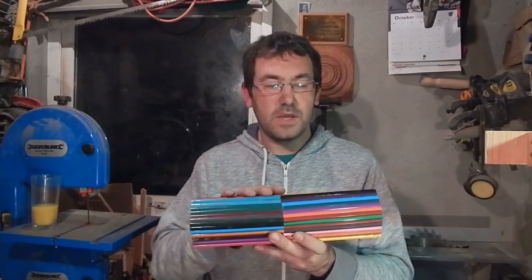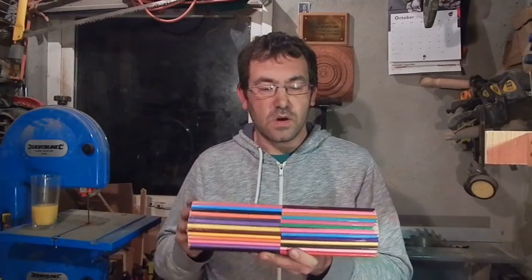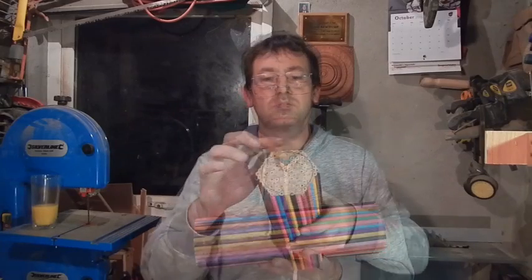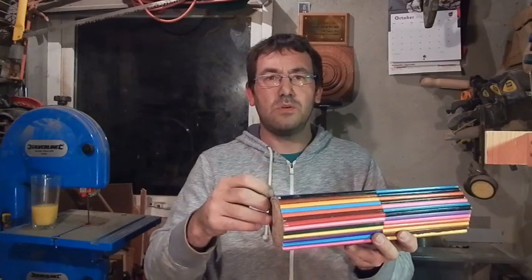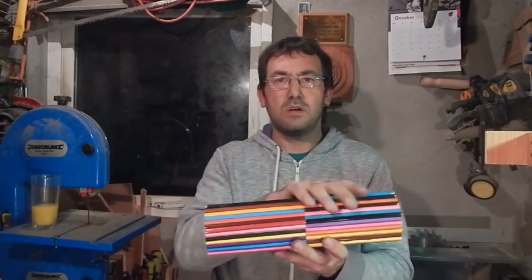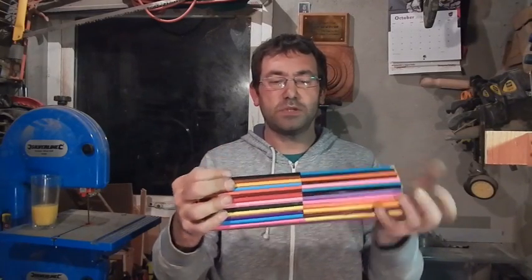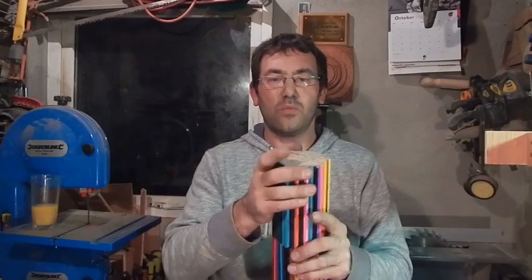I've decided what I'm going to make. I've made one before, but I've never videoed it, so I'm going to go ahead and make a goblet, especially for you, Mike. These pencils are very weak on the edges, so when you're coming in on the edge, you're going to get a lot of chip out and break out. What I found in the past, when you're working on a pencil blank, is that if you can incorporate some wood into it somehow on the ends, it really helps when you're turning it, because it keeps all the ends together, and it just makes the whole blank a lot more solid.